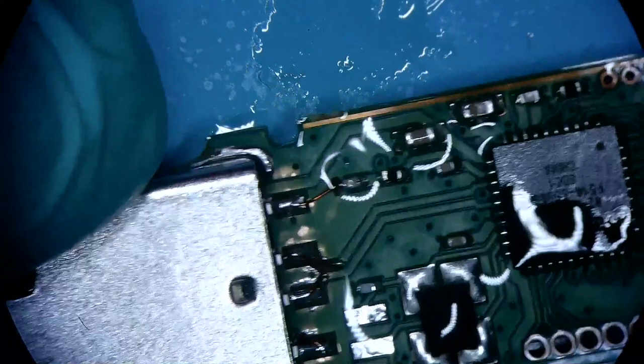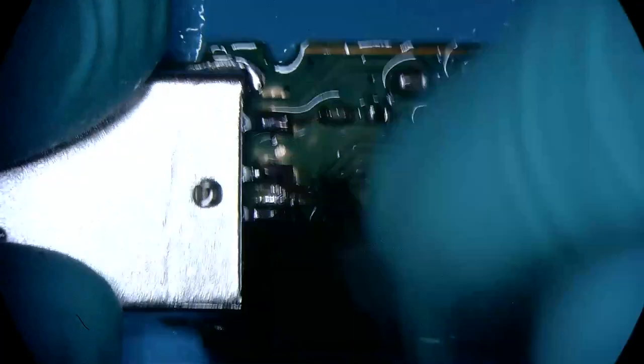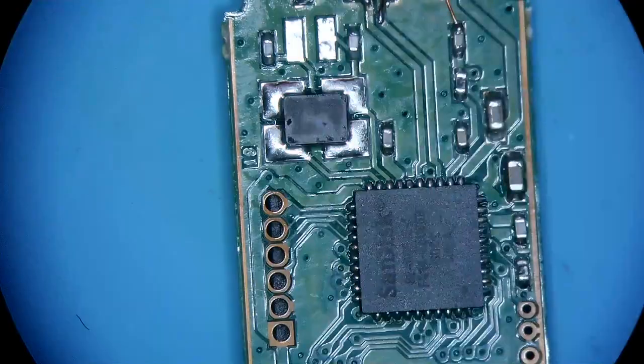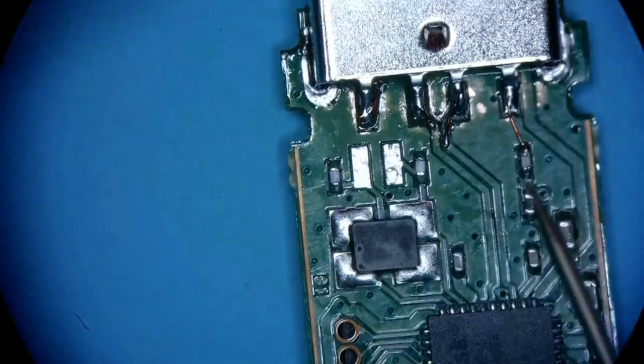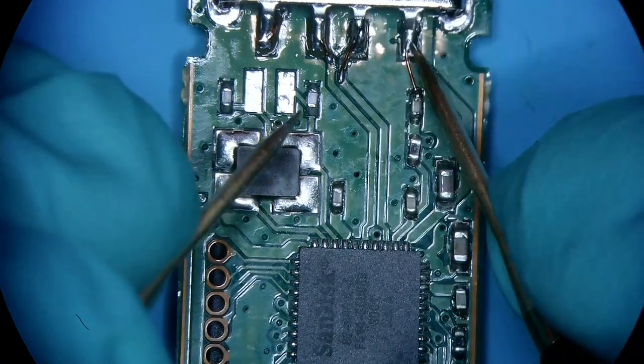Before we fire it, though, I did mention that I'm gonna show you how to test them to make sure they're, first of all, not in short, and second of all, that their connection there is good. So I'm gonna grab a multimeter, set it into test mode. When we hear this beep, that means we got connection. So there's the connection. This is our ground.